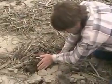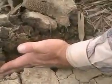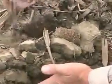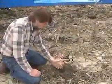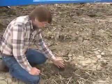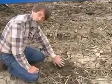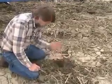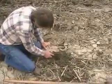Here again is another piece of soil that has been lifted. You can see the incredible amount of fracture force that's been exerted. The force between these 7.5-inch spacings going all the way over to the other tine mark over here. Now we're going to take a look at the side of the hole, or the tine insertion, where there was no compression forces applied to fracture soil. All this is the evidence of the relief that was caused when the tine entered and moved away. And you can see these fracture lines.